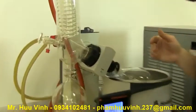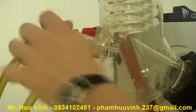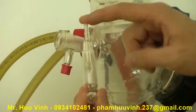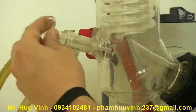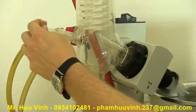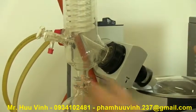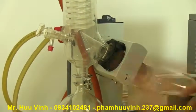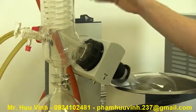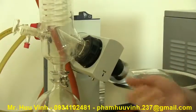We have our manually controlled stopcock, and there are two holes — one on the outside of the glassware and one on the inside of the stopcock. If you had the inlet pipe connected, that would feed all the way down through the entire system, and using this would be a bit more cumbersome — that's why a lot of chefs prefer to just leave it off. We can hold vacuum by rotating so the holes don't line up, or we can break vacuum by shutting the vacuum pump off. As you can see, if you can easily remove it, you've broken vacuum.